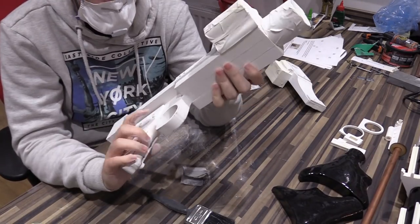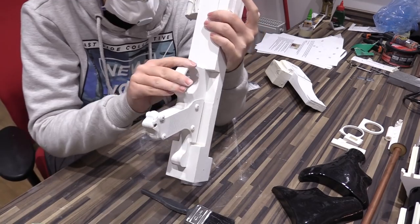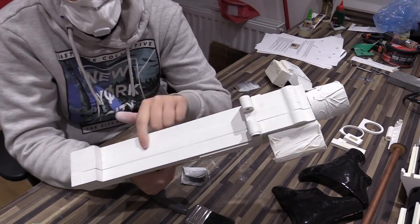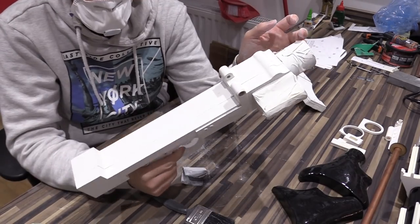So that wood primer is on. It sort of picked up all the little fluffy bits on the wood, which has made it a lot easier to sand off. So now I've sanded it fairly smooth. I'm just going to get some filler and fill in some of the gaps that are still between these three wooden pieces, and try and get it as smooth as I can.